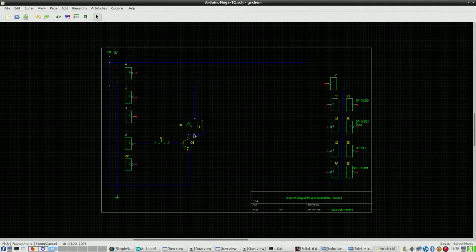If you put some current on it, and you interrupt the current, then you take away the source, the magnetic field which has built up unleashes the energy and may give a very big voltage back, much higher than what came with it. And that is the reason that you have to have a protective diode, so you don't ruin things. That is one thing.